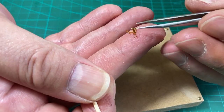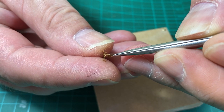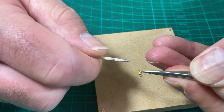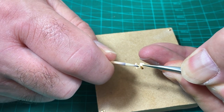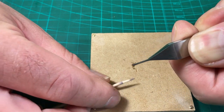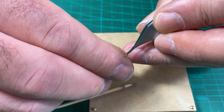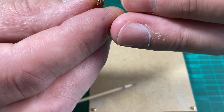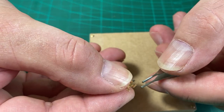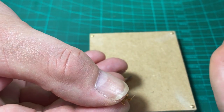This has been bent but it needs to go further. I'm bending in the right direction so far. That top part needs to fold out about 45 degrees - that's a bit too much. I have to be careful because you can only bend these once maybe twice and then they'll start snapping. Try to get your bends in properly. With that bent this way 45 degrees, the top strip needs to go back the other way 45.